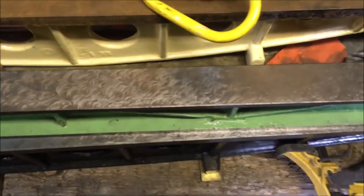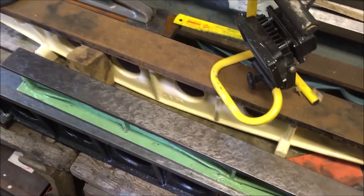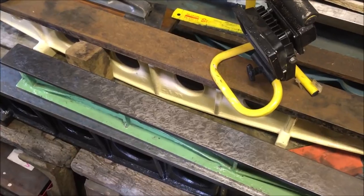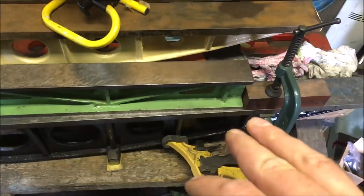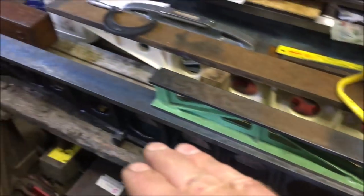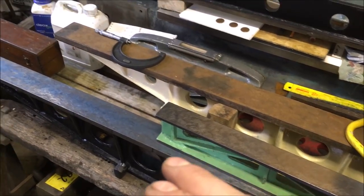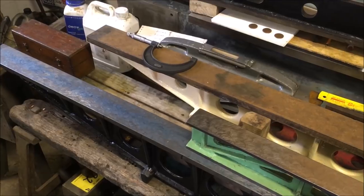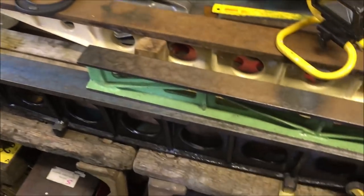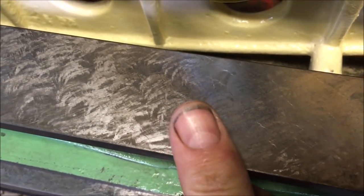Anyway, that's what he got to at that stage and said, right, well, that's roughed out, I'll bring my small scraper through the week, finish it off, and then the plan is to use that parallel, sat on the straight edge that it's sitting on now, and then bring that straight edge in using a spirit level, machinist level. I mean, those are about inch diameter.